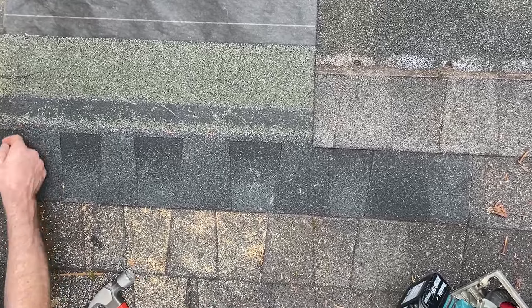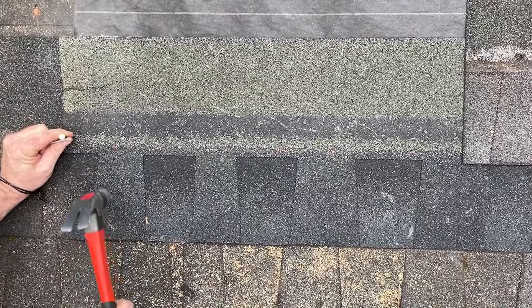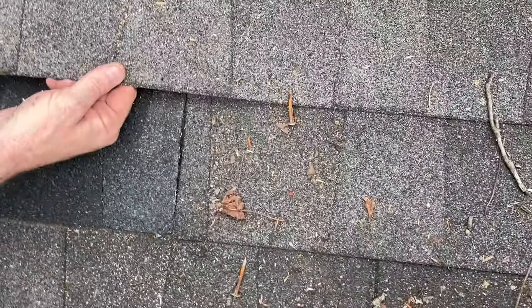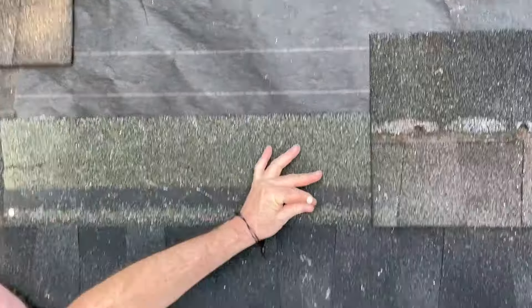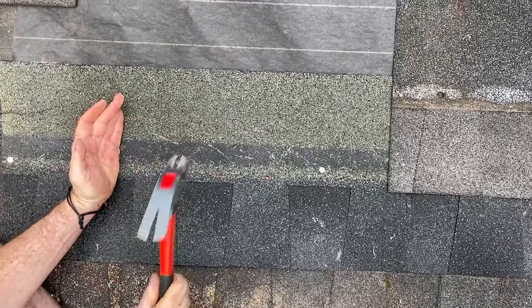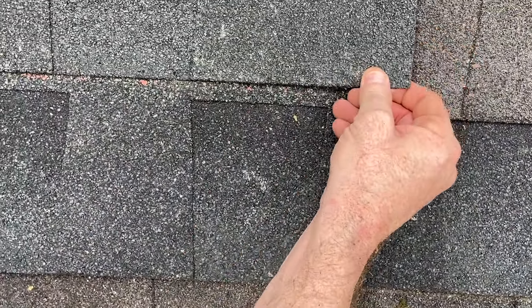Now we lay the shingles back in. My friend told me, 'Oh, you're a better videographer — you shouldn't do photos, you should offer to do video.' When I nail it off, I like to go above the shingle, because the next shingle is going to lay down to this line right here. I like to go above that line and catch the edge of this shingle. And I don't claim to be some big photographer, but since then I've had photos published. Then you can catch one a third of the way through the shingle and two thirds. See how the next shingle covers up that nail head.